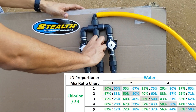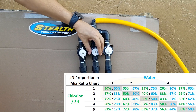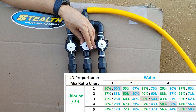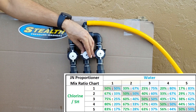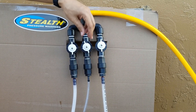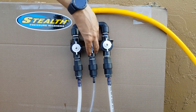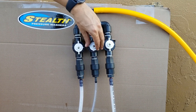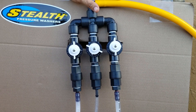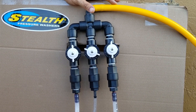As far as the surfactant line — this center one — I'm not going to tell you there's a specific number to use, because honestly that's the truth. Different surfactants have different mix quantities that they expect you to use, and on top of that, based on your personal preference or experience, you're going to want to use different amounts of surfactant anyway. You're probably going to be at two, maybe three or below. I personally haven't found many reasons to go up to four and five, but there certainly could be situations depending on the type of stains or growth you're attacking on roofs or walkways.